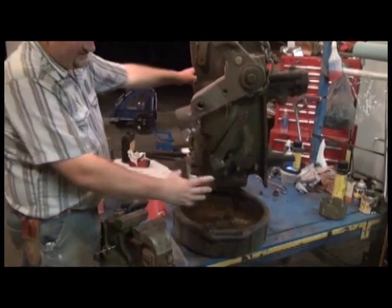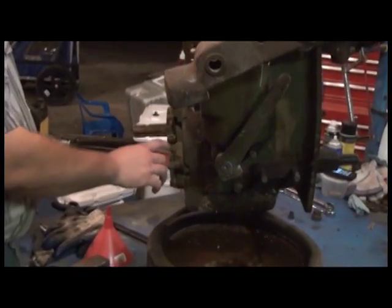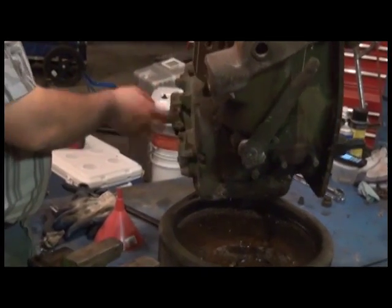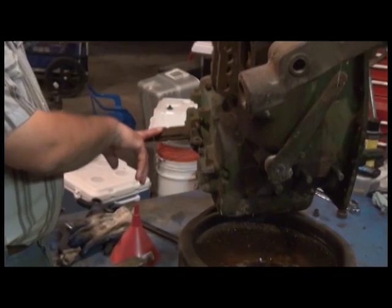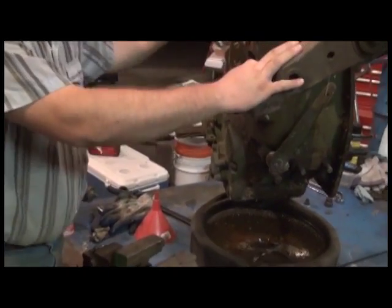You have a clutch pack that sits inside of this housing, and then at the very last there's a set of gears in the outer end of the clutch pack, and then another gear on the shaft held on two bearings that comes out as your power shaft output shaft. That's a lot of shafts in the same sentence, but I think you know what I mean.